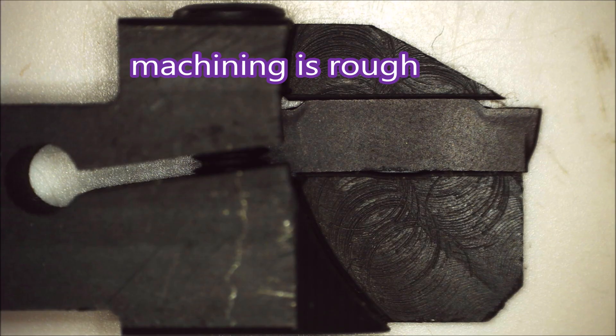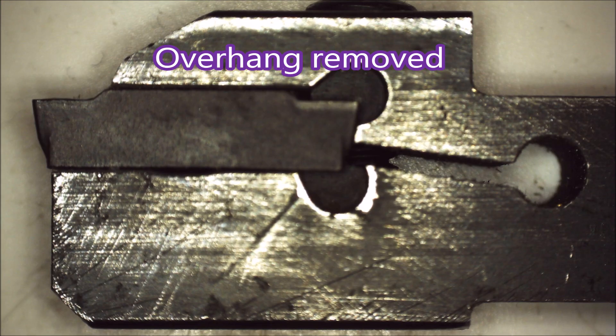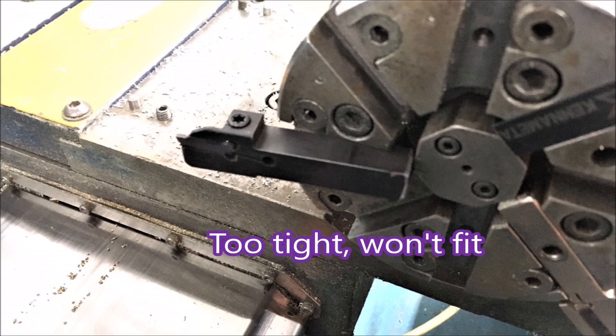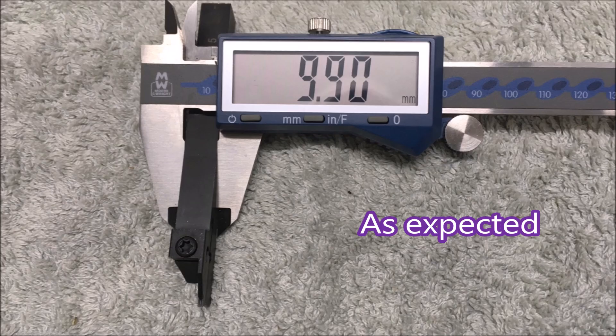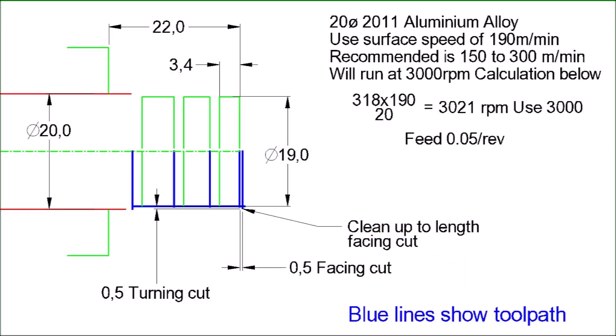You can see the machining on the eBay unit is fairly rough — really rough, let's face it. There's an overhang over the insert, like a little veranda, that needs to be removed. So I removed it with a file, and all the shiny stuff is just where I used the file to take off the high spots. I didn't realize how bad it was. My first problem: the darn thing wouldn't go into my turret — it was too high. It measured the right size across, but vertically it was just too big, so I had to attack it with a file.